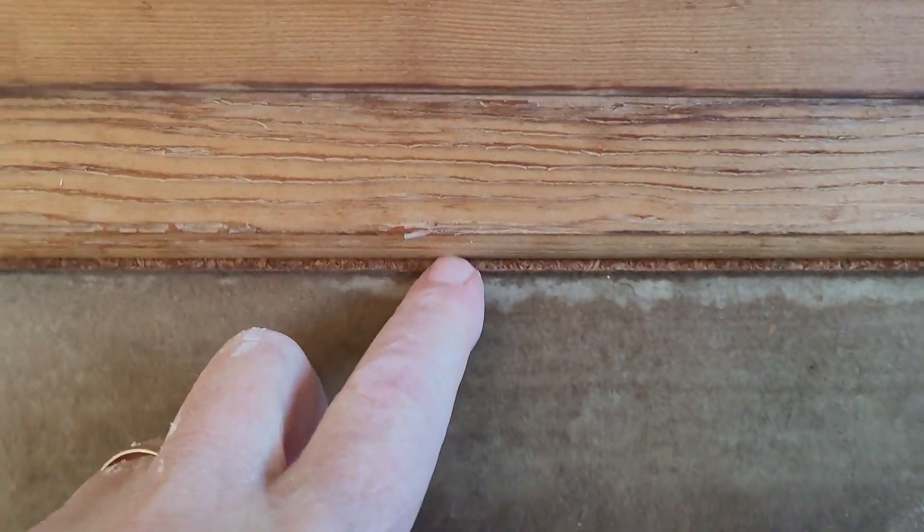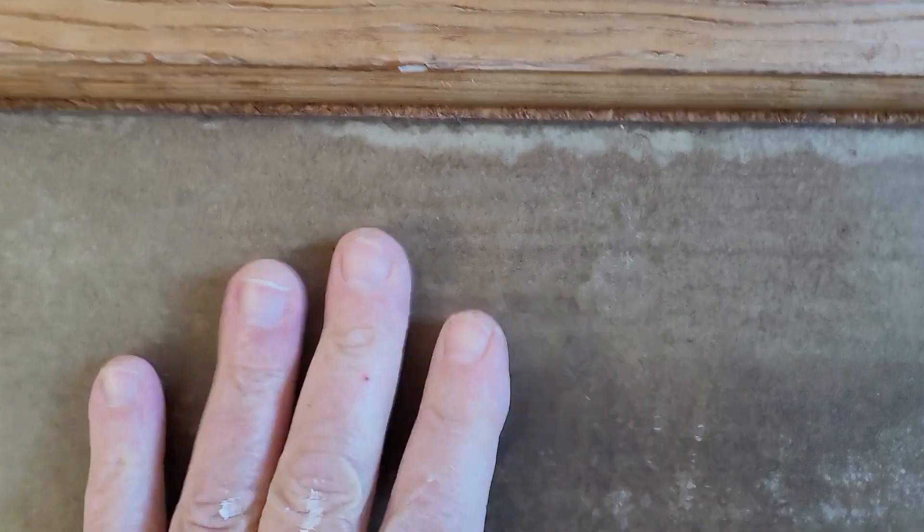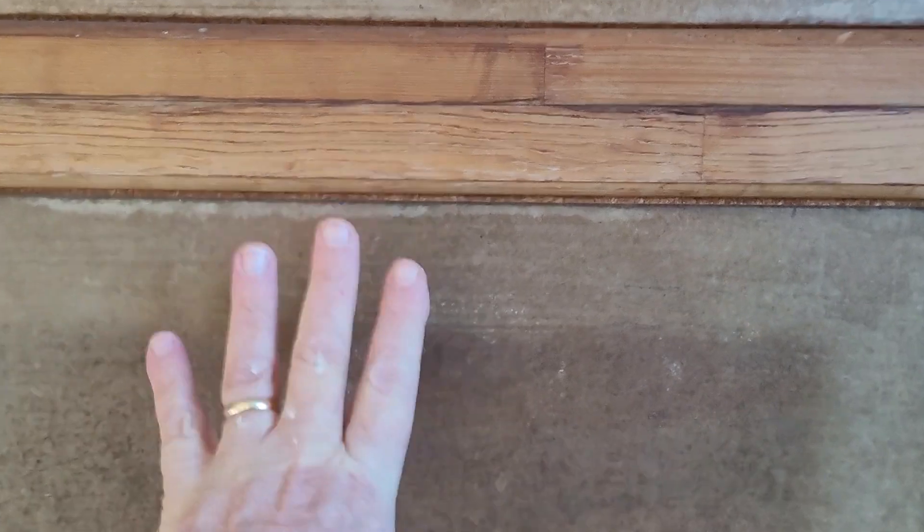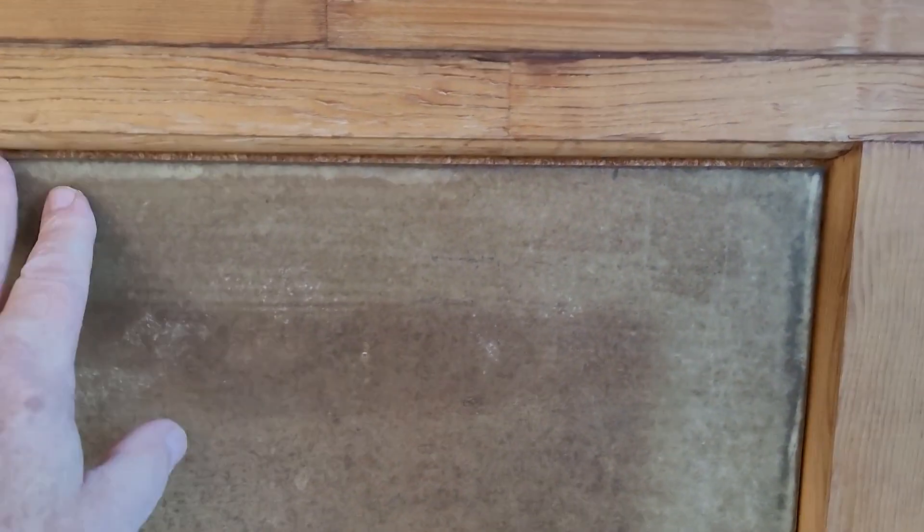Part of the issue is you can see right here there's a gap. These panels are added into this — when it's constructed, it's kind of like a picture frame and these panels are cut and then slid into it and glued into place. But this garage door is probably 30 years old now. It still works and it's a little heavy because it's wood, but it's still functional. The glue breaks, the panels loosen up, and they slide around in here. I think part of the creaking and groaning is because these need to be re-attached so that the garage door is more of one unit.